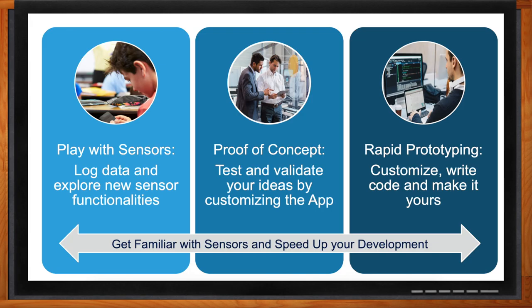Additionally, the hardware is very flexible for professional users as well. If you are already familiar with sensors and are a professional developer, you can rely on the low-power yet high-performance STM32 32-bit microcontroller from ST — specifically the STM32 L4, a low-power M4 core — which allows the user to write their own code and benefit from many of the tools that ST provides, such as the STM32 CubeMX code generator tool. The Sensor Tile Box features eight advanced sensors on board, giving users with a single hardware form-factor device with a plastic case the ability to get started and create their own application from entry levels all the way to professional levels.